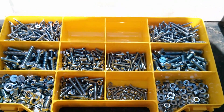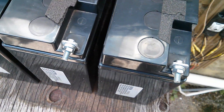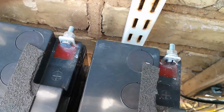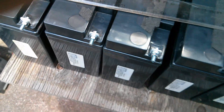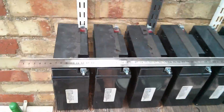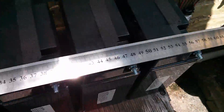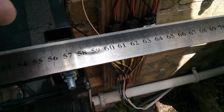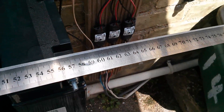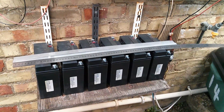Klas Olsen's 950 piece nut and bolt set to the rescue. Brilliant. And we've got bolts in the battery terminals now with washers and standoffs. So I just need to get a measurement for the distance between these. I'm going to have a little bit of overhang of this aluminium strip at each end — six centimetres at each end, which conveniently works out at 64. So I'll make the strips 640 millimetres long each — two strips, 640 long.